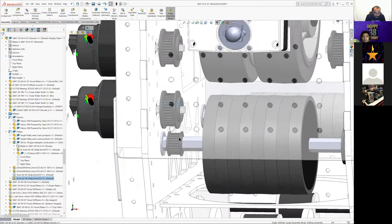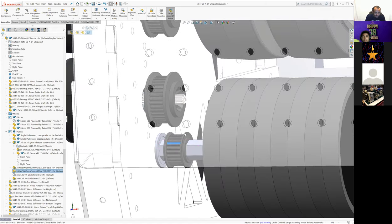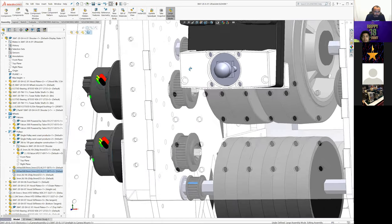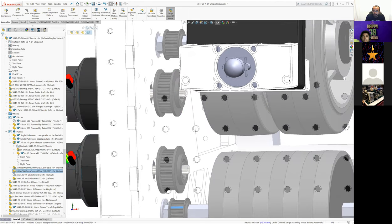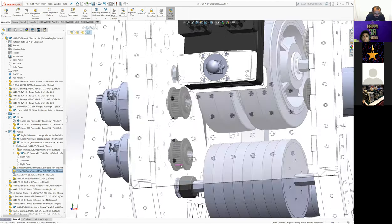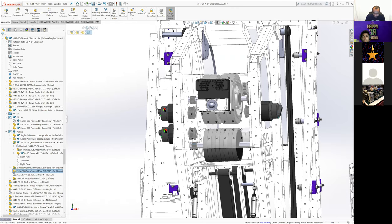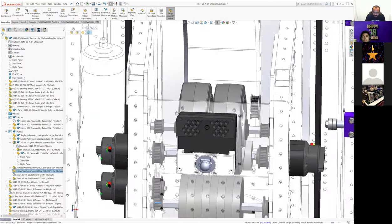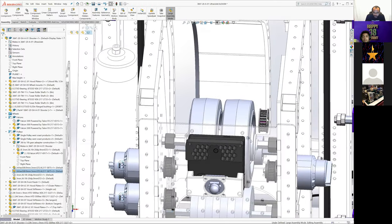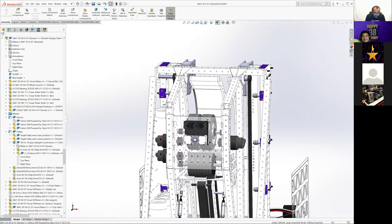So we're basically just using that pinion gear as a spline for this outer pulley. And then I think all of these were actually aluminum 18-tooth VEX half-inch pulleys, I believe. I don't think we ran printed on any of our comp stuff. I do not remember the belt spacing here, but somewhere we have that documented. They're just relatively small belts from V-belt guys, where almost every one of all of our timing belts come from V-belt guys for the most part. Or they're like old stock that we had from either VEX or China or somewhere else. I have no idea what that is. That's just a random floating pulley. That doesn't exist. Okay. So that's the shooter powertrain.